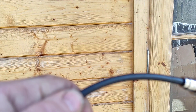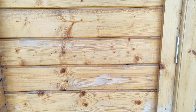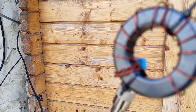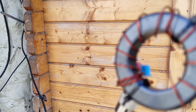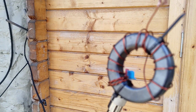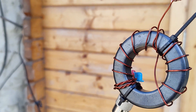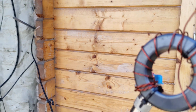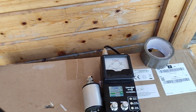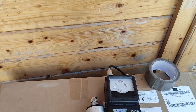The coax is becoming part of the antenna via common mode. Some antennas actually make use of the antenna wire and the coax radiating together. The Carolina Windom comes to mind - it uses a line isolator a quarter wavelength down, actually using the coax to radiate, but then has a line isolator after that point to stop any more. The flowerpot antenna uses the same principle, using part of the coax to radiate, then puts in a line isolator to cut it off from that point.